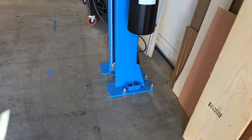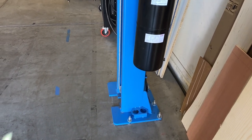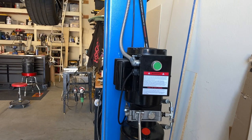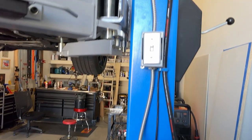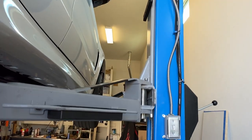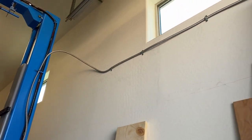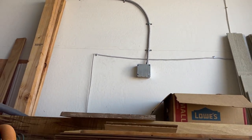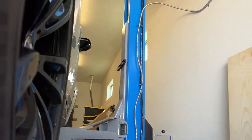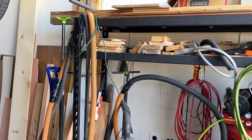Moving on from the base plate and mounting situation, let's touch on con number three: power source. The motor operating unit is 220/240 volt, which meant I had to bring power to it. I do have an emergency disconnect so that if something goes wrong while I'm using it I can shut it off. The power runs up through flexible conduit and into a junction box — my panel is right behind the wall. In a lot of cases it's not a big deal, but in some cases running 220 volt power can be difficult or expensive. In my case it was a short run, and it only needed a 30 amp breaker, so I got away with 10 gauge wiring, which kept the cost down.